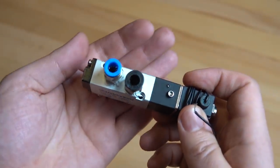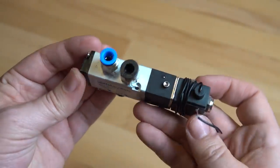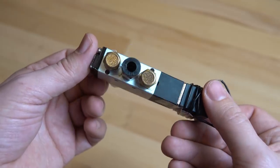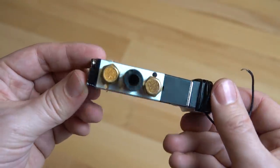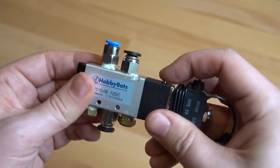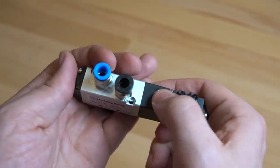If we take a closer look, you can see there are two ports for each side of the piston, and on the other side there are two exhaust ports. I put silencers on these because I want to be nice and quiet so no one can hear what we're doing. There's also a port for air intake, and this one has a button for manual control. You can also use electricity to control this, maybe with something like an Arduino, but for this invention we're just going to use the button.